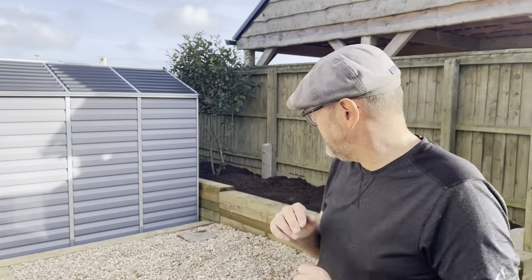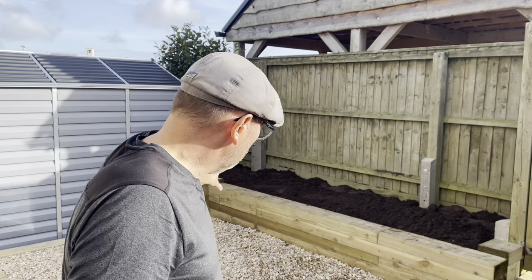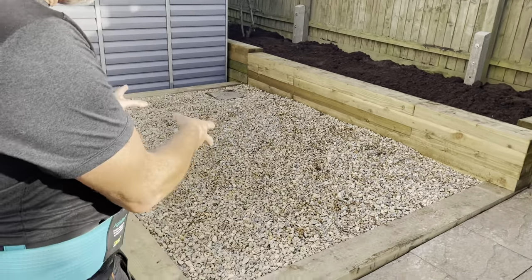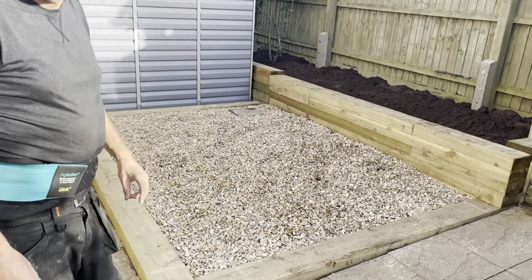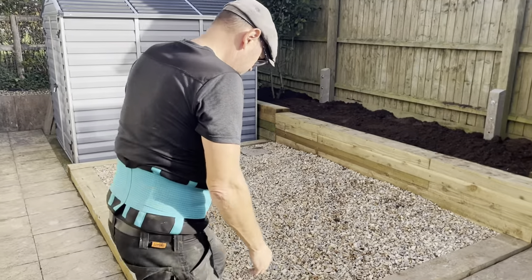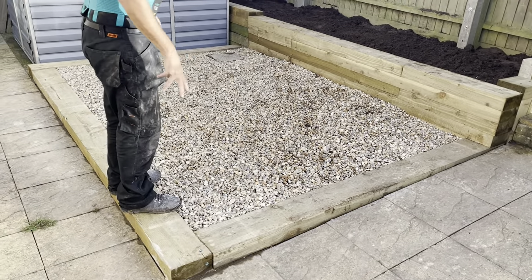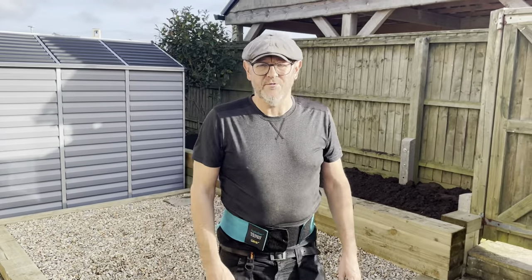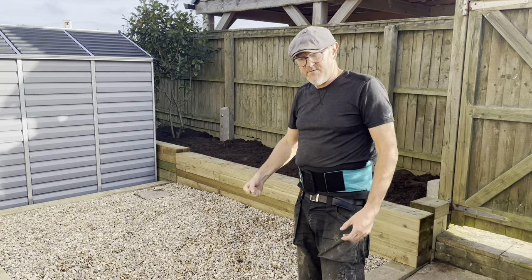That's that job done. We have built a sleeper wall with a raised bed and wall around there, which we filled with shingle. A really nice feature that has really tidied up this garden. We bedded all this in as you saw — aggregate underneath, then concrete. These are bedded in and going off nicely. We've filled this with shingle — there's a ton gone in there that we lifted.